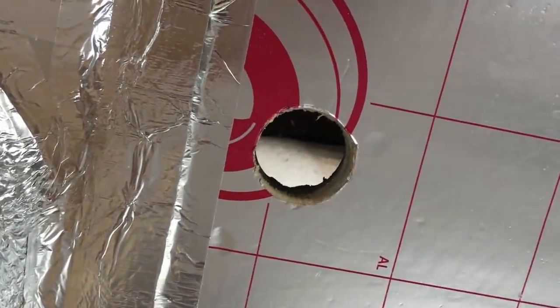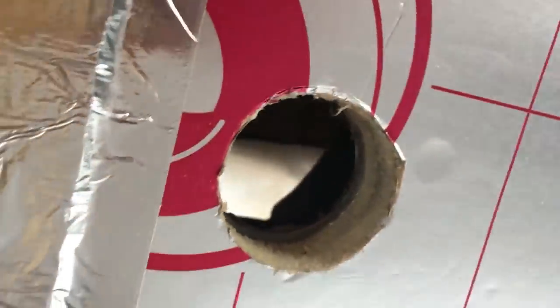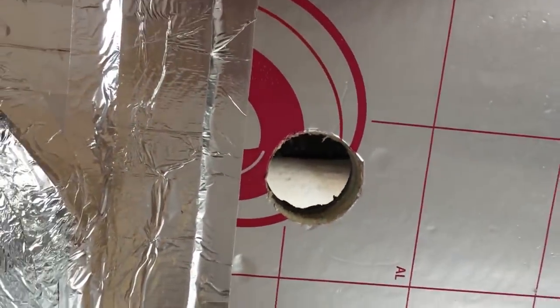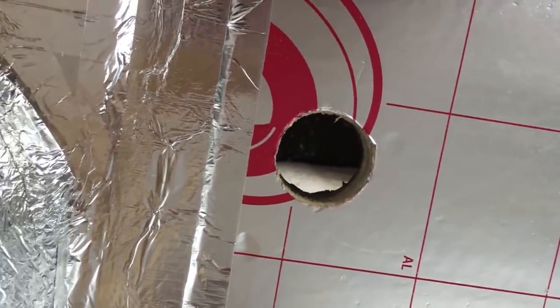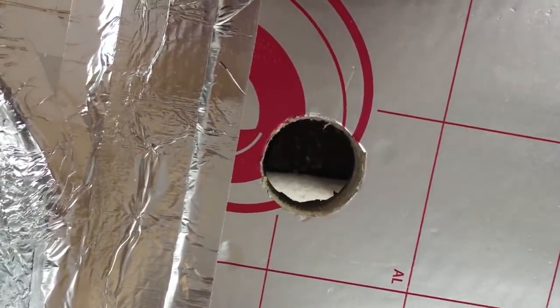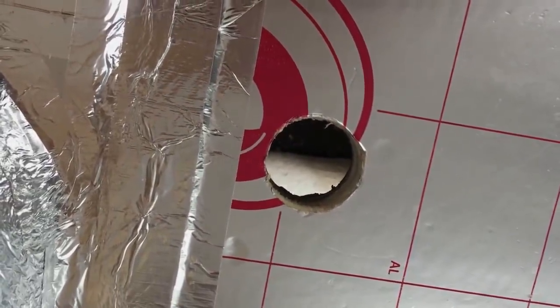So that's the hole for the shower waste through the belly of the van. You can see the ground out there now. We've missed all those main chassis members. Good bit of planning there. This is the only one that's in a fixed position. So this is the only one I was really majorly concerned about. The other holes for the sink waste and the dropout vents near the heater and near the gas bottle, we've got a bit of scope to move those around.